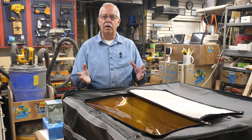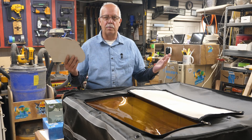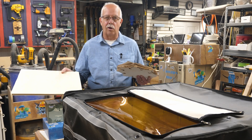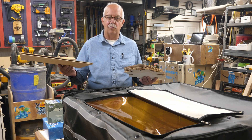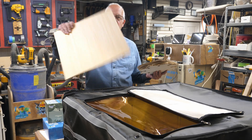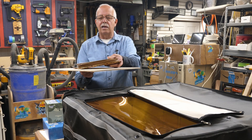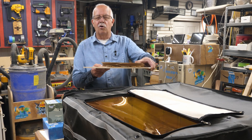I also have to size the wood. I'm going to try to design these using, at least for the smaller box, these Dollar Tree shapes because just about everybody can get those. But I'm also going to size it to use eighth-inch plywood — not everybody has easy access to eighth-inch plywood or they have to pay a high price for it at a hobby store. If you have a Home Depot close to you, that is one place you can get this eighth-inch plywood; it has a birch or basswood finish on one side and a neat grain pattern on the other side. It's a kind of a neat wood to work with. I've done a video on how I cut this up and store it because it's really hard to keep this stuff flat. If you do cut a bunch of it up or buy a bunch of these shapes, stack it up somewhere and put a heavy weight on it with a piece of cardboard to keep everything flat so it doesn't curl up.